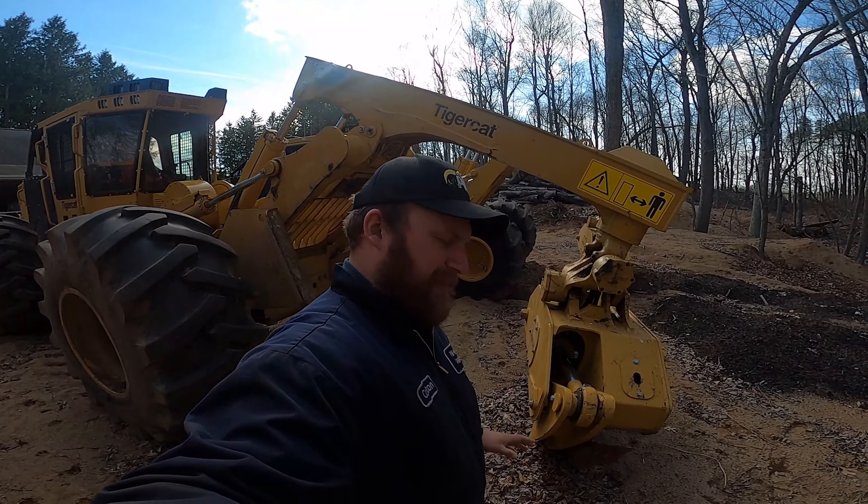All these gravel pit jobs and land clearing I'm doing, that's going to help out a lot. It's going to do better in the low ground — does better in the hills too, that's been proven. I've got a set of tracks coming from Ricer Equipment when they come up this week. I'll have a set of tracks to put on in the winter or low ground, whatever I need. You can put tracks on the 620 around the tires, but you don't get the flotation as you do with a bogie with two tires — that's why it'll do a lot better in the low ground.